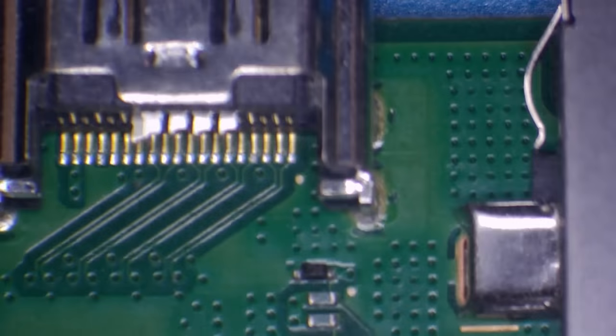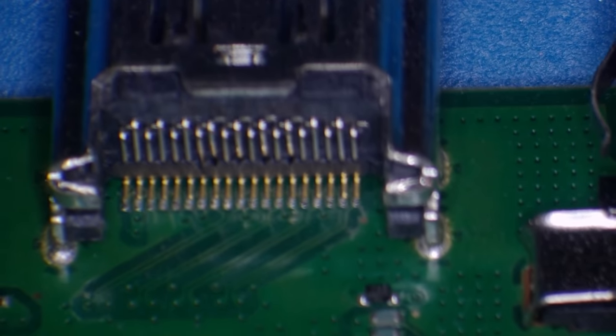So like I said, the first thing that I noticed was the fact that these HDMI pins are sticking out, and that the HDMI port is probably going to need replacing. Well, not probably, it's definitely going to need replacing. I've just pushed them back in a little bit, but they can't stay like that. But that was definitely damaged. I'm wondering if maybe someone spilt something on this and then basically quickly pulled the HDMI and power cable out, maybe. And that might actually work, you don't know. But I'd probably change that just as a precautionary measure.